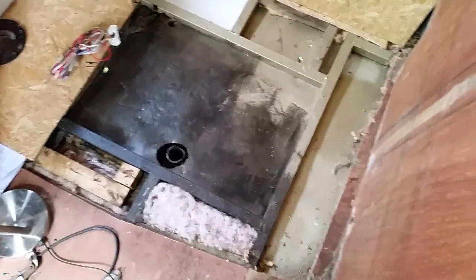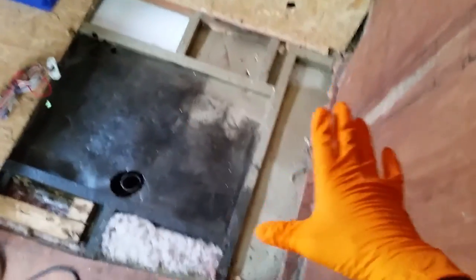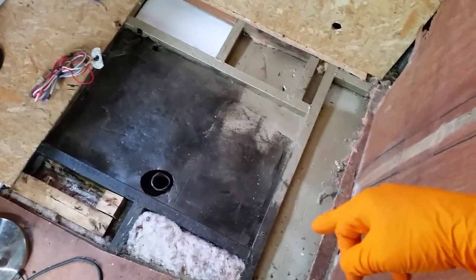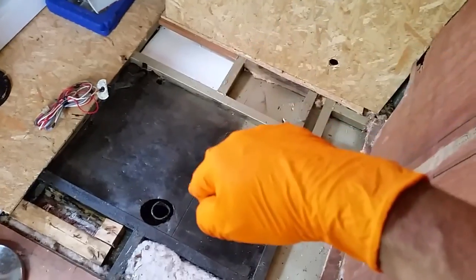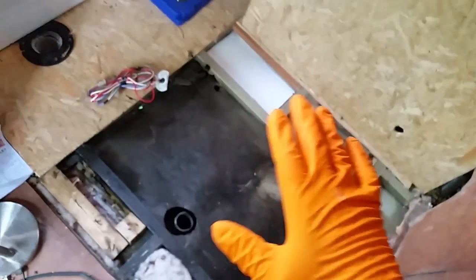Right, the second half of the floor is painted — treated I should say — all cleaned down, wire brushed, vacuumed out and everything, and it's been treated with a metal protecting paint. I ran out of the gold so I finished it in black, but hey-ho, you're not going to see it. Just to recap: shower goes in here, and I've got to work out on this piece here, which lays flat there, where to drill for the waste trap. So basically insulation, work out where the waste trap goes, get this floor fitted today — I want it in and fitted, all in place.